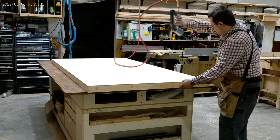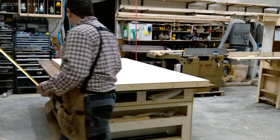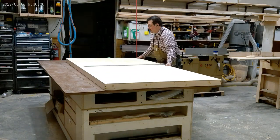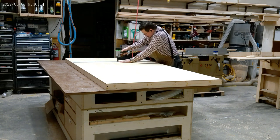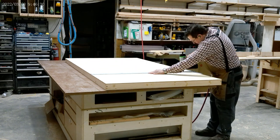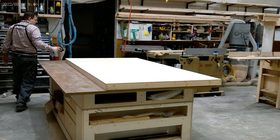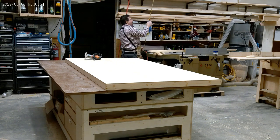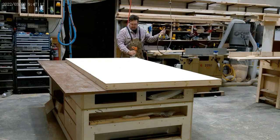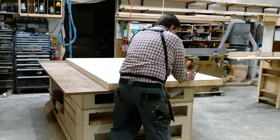I'm putting marks at center, two, four, and six feet because it's an eight-foot flat. The T-square I'm using is made by Star — it's a decent T-square, but I constantly get glue on it and I'm lazy about wiping it off, so it's no longer perfectly square because of glue bumps. I set it off to the side of the lines; I need both lines to make sure I'm centered on the pine and use the T-square as a guide. I have a trim router — the retractor cord lock is gone so I just use a pony clip on the extension cord — and I'm doing the flush trim, where it was overhanging about a sixteenth to an eighth of an inch.